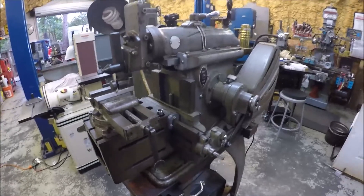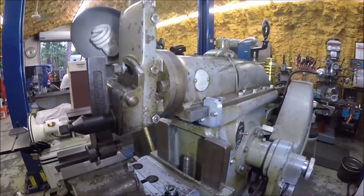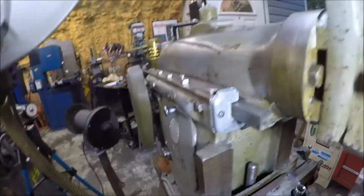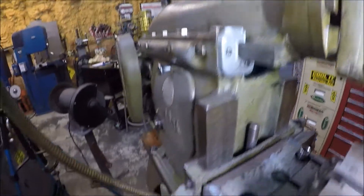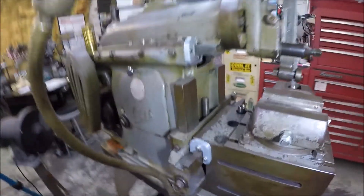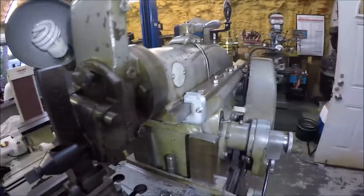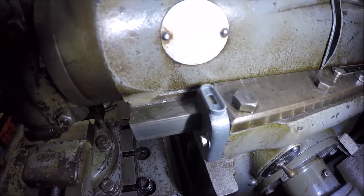I'm going handheld so it'll be a little shaky. If you remember mail call 17, I mentioned the wipers and the retainers — I've got them installed now. Nice upgrade on the shaper. Now it'll act like a 1941 and later model, because that's when those were added. The oil won't be draining all the way down the ways and onto the table. Pretty easy — just drill and tap some holes, put a little oil on the tops, and it keeps everything nice and wet.